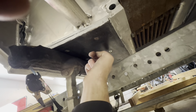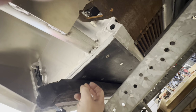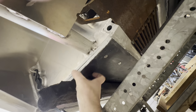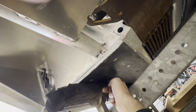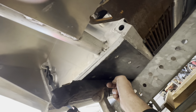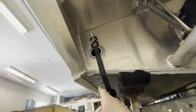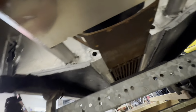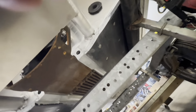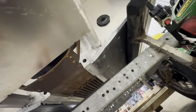It ripped right through, not these ones, these ones are new, so I had to do these after the fact, but yeah, there's only bolts up to here. And the UHMW just pulled straight off, straight through those bolts. The bolts were still hanging out in there. Ripped off the first three. So, actually the first three and then the first two on the end. And then it was just flapping around like crazy. The boat was porpoising like mad. So I put it back on the trailer just to figure out what the hell it was. And yeah, it was both sides had ripped off.